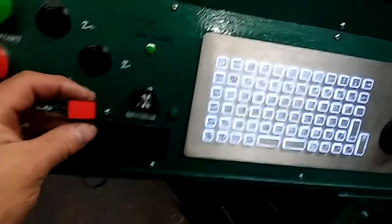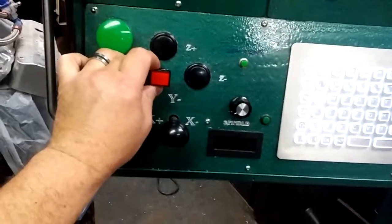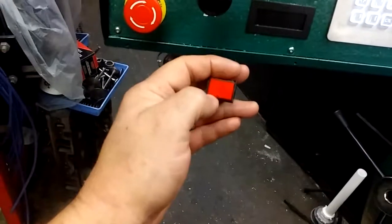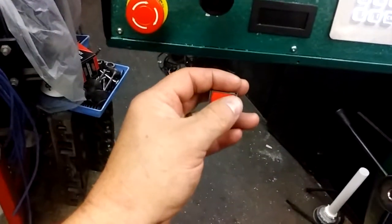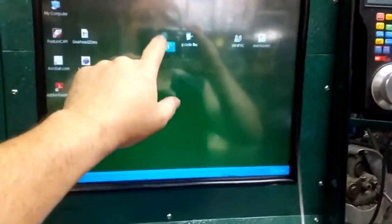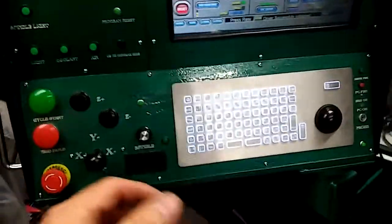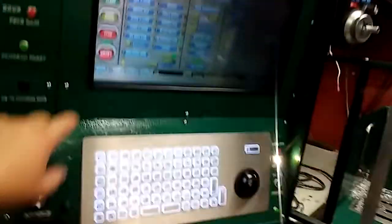So that being said, I do believe it's going to go probably here, and then I'm going to go ahead and engrave on the other CNC stop. And the reason I say that is because, let me go ahead and boot that software up. As anybody who uses Mach 3 knows, you can set a safe Z. So what is so neat to me is the fact that I could be in code or running a program, and I can hit reset. Here, let's turn the drive on.